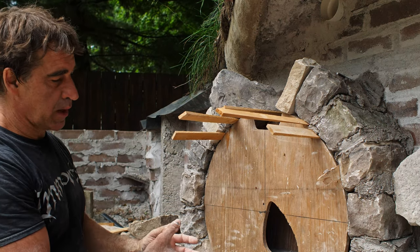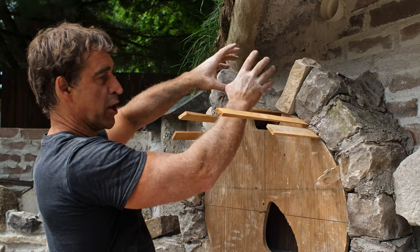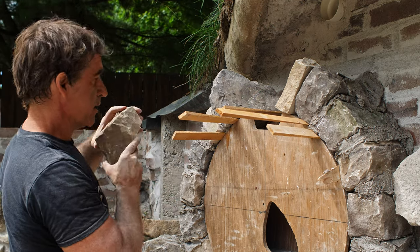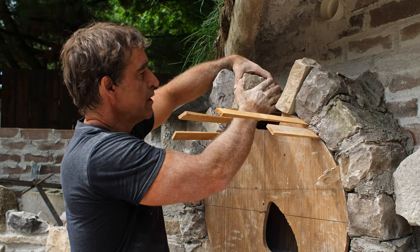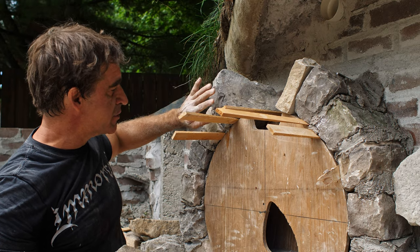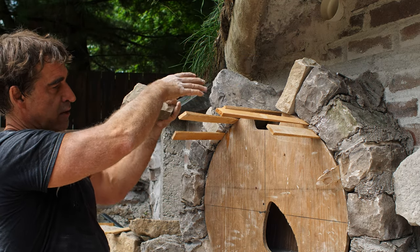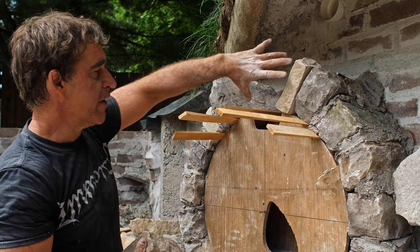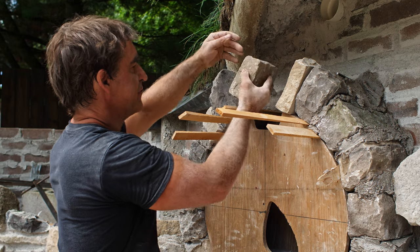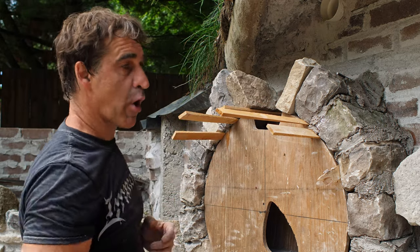Okay, so I'm always hoping when I start out that the general size of stones I use are going to magically work, that everything will come to the keystone exactly where I want. That did not happen. So I had to go for thinner ones here of my last light stones in order to get sufficient space for a dark keystone. Also this last stone here is kind of kicking out this way. It's no longer going square in that way. It's coming over, and that could have been happening all along. And now suddenly it's quite tight at the inner part there and very open here. So what I'm thinking of doing is putting this stone in here to disguise what's going on there, and that should even out my trough there for the keystone.